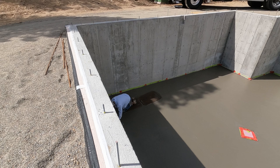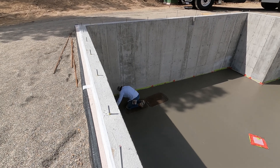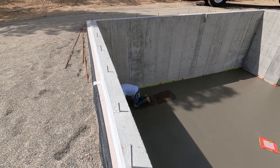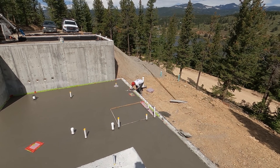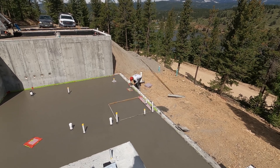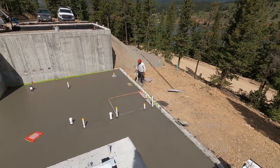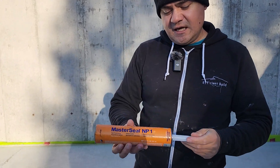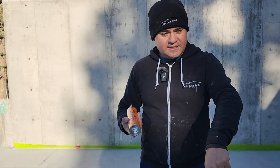I naively thought that the floors were pretty much done, but there are two additional steps to make them even nicer. First, workers get on boards that allow them to get into the concrete and start polishing, then they use some sort of skis to polish it even further. The top of the backwater valve box was covered with concrete, and I asked the crew if they could make it a little bit nicer — and they did an amazing job. The final step is to apply the Master Seal NP1, which is basically an acoustic sealant we're putting inside the control joints of the concrete.